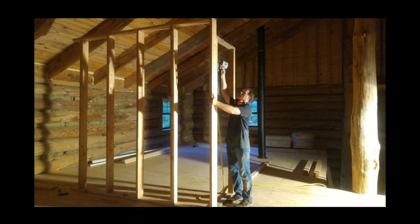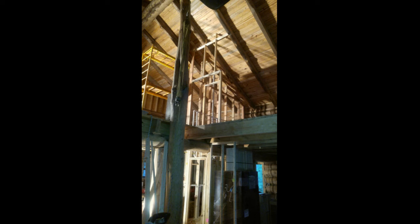The most exciting part of the build is definitely stacking logs — everything else after that is just normal construction. In an LHBA home you can put the walls wherever you want since they are not structural. We started with the kitchen wall since the bathroom, laundry, and bedrooms were all dependent on its placement. My wife spray painted on the subfloor where she wanted the walls and I did all the installation. We decided to run all the electrical through the interior walls instead of the crawl space to minimize holes in the floor. I also partially framed in the upstairs bathroom since we needed the framing to support the drain lines for future plumbing.